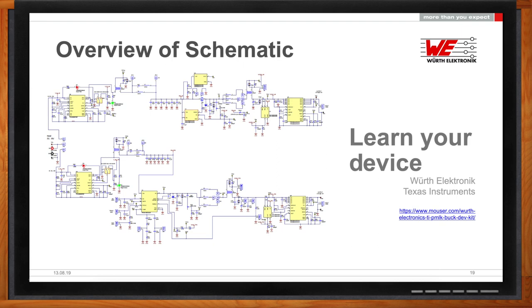We have two controllers independent of each other. You can choose to go through DC-to-DC Converter 1 by means of a couple of jumpers, or DC-to-DC Converter 2 by means of the other set of jumpers. And it will take you through step by step: understanding how to do current sampling measurements, efficiency measurements, and ripple current measurements.